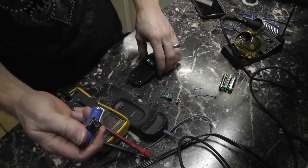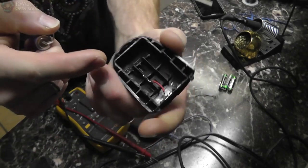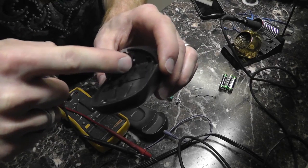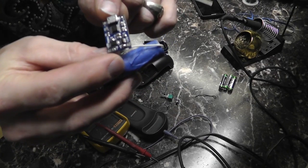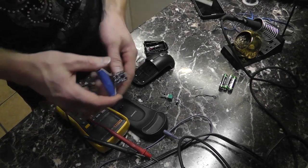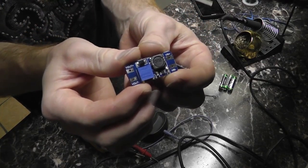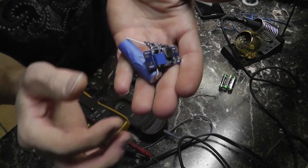Getting into this, it basically only has two pins: power and ground. The good thing is the actual mouse has the charger output, the voltage battery input, and the ground, so I can isolate these. This charger happens to be 6.5 volt down to about 4.5 volt or something. The output voltage here is actually about 8 volts — according to the charger it's 9 volts. So what I'm going to have to do is put in one of these other little cheap circuits that will basically convert my voltage down to the correct voltage. I'll have to adjust it and set it, and pack all this in here.